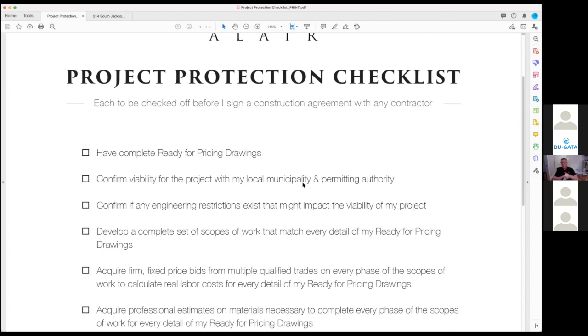I have a question here. If you're not changing the footprint for a remodel, do you have to worry about setbacks? Yes, you do. You want to pay attention. Generally speaking, you can go right above your current footprint of your house, no problem, except, and you've all seen these across Arlington, lots and lots of people have the old side porch that has been enclosed and is now living space. And that is a lot of times not within your setbacks. Arlington County will still ask you for permission to enclose that. So that'll still have to count, and you'll still want to check your setbacks.